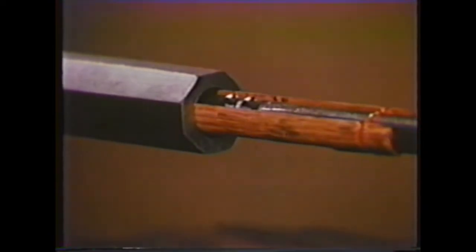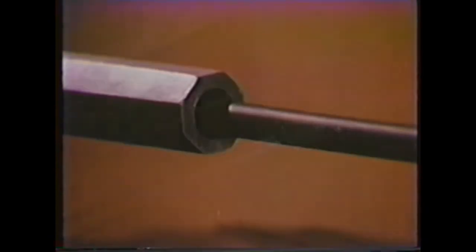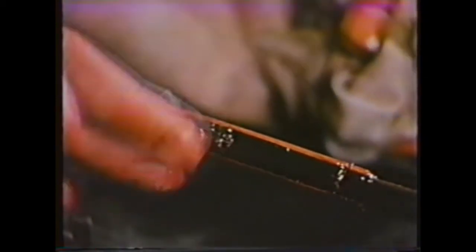The rifling grooves are cut with two steel teeth set in an iron rod. The rod is pinned to a spiral guide. A wooden shim is placed behind the teeth. All the cutting of the rifling is done from the breech to the muzzle. As the teeth are pulled through the barrel, they are turned by the spiral wooden guide, reproducing the same spiral pattern on the inside of the barrel. After each cut, the guide is rotated to its next position. There are seven grooves on the spiral guide, so there will be seven grooves in the barrel.